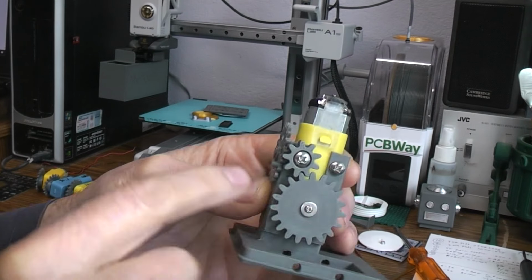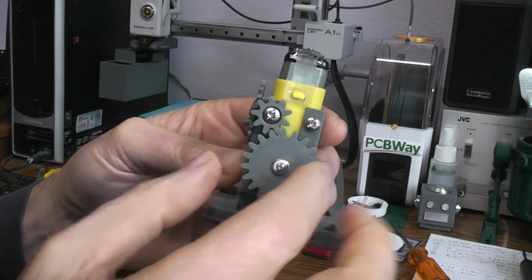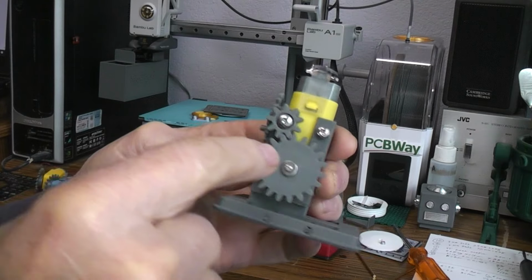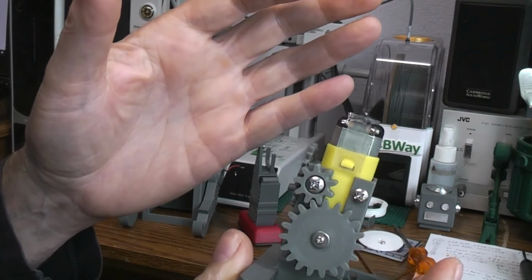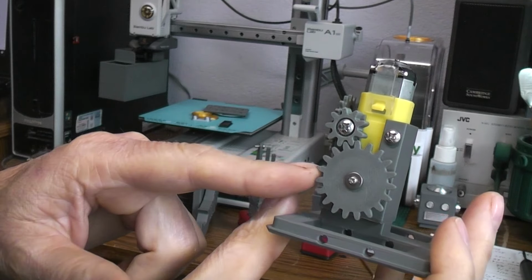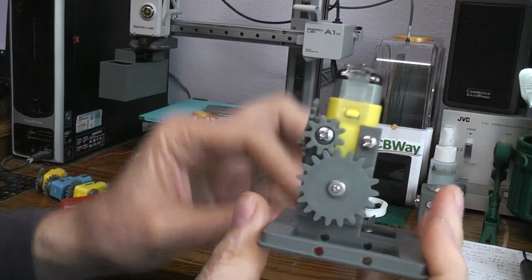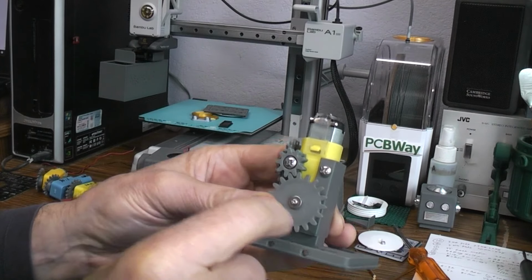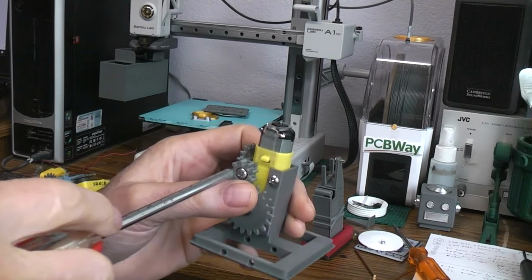And so the purpose of this whole gear is we're just trying to transfer power from this side to the middle for the chest drive. So this gear in between, I don't know what to call it. I'll just call it the small gear, but it's basically an idler gear. This one drives that one, and then that one allows us to drive this one at an angle. In order to swap motors out, I'm going to have to pull at least this little gear out.